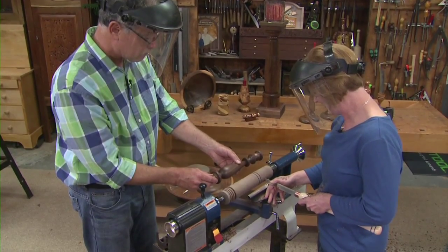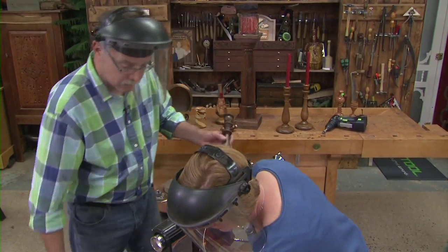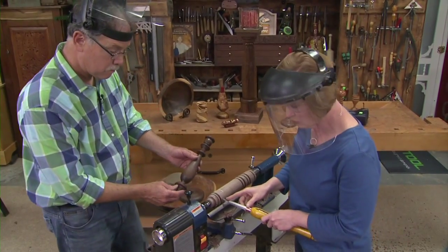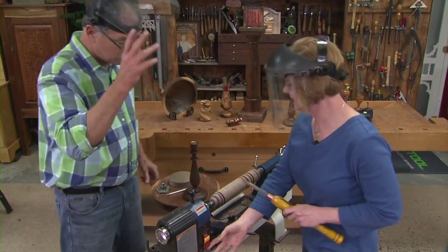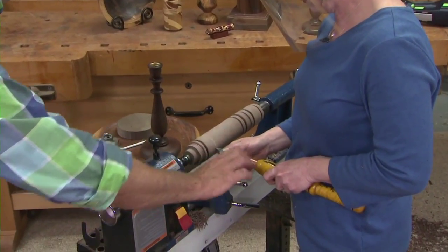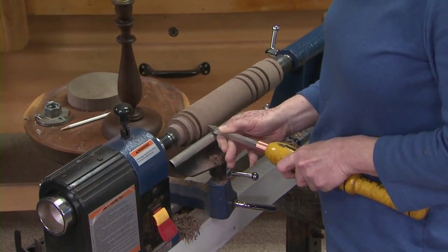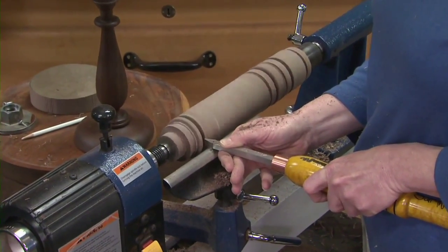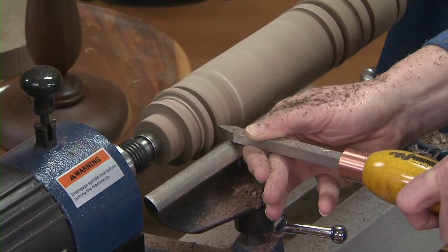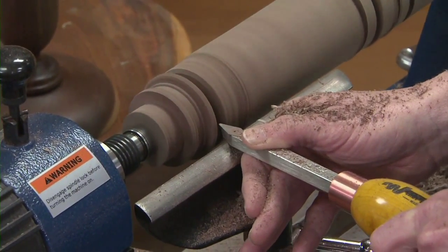Man, it's like cutting into butter — it's walnut! Now it's time for the detailer. The detailer has a diamond-shaped carbide cutter. I'm going to go in and work on this cove, work some of the material away, then also use the finisher. Keep it level and pinch it in — the chisel is always flat to the tool rest, never rocked to one side or the other. I love it because you can get in there and work the material away with such a small cutting edge.